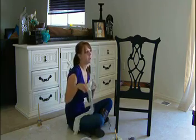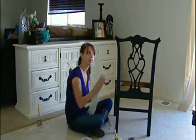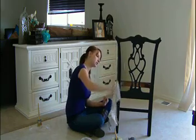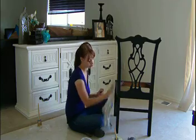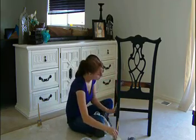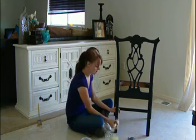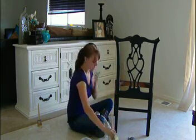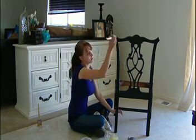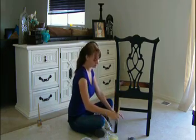The only benefit you're going to get from putting another coat on your piece is that it evens out the wax. So sometimes it will help if you're having an uneven finish. But in most cases, it's not necessary. Another thing I want to talk about, because I think where this comes up the most, is with tabletops, specifically dining tabletops, because they get a lot more wear.